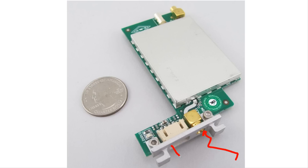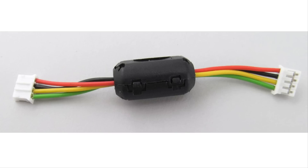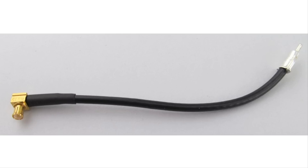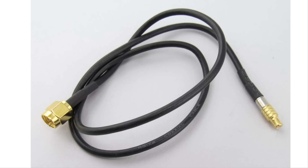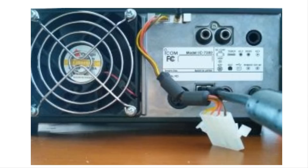You don't have to connect it up. By the way, this modification is entirely reversible, so you can just take it out without changing anything — nothing soldered, nothing like that. This is the cable that is used to swipe power from the external antenna tuner. Here is a cable that replaces a cable inside the radio. If you aren't going to use the tuner cable, I would suggest putting it in a plastic bag, labeling it very clearly, and if possible attaching it to a coax or power cord so it doesn't get lost. Then another cable goes over to the software-defined radio.